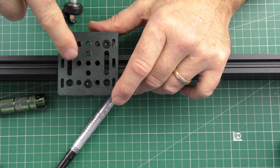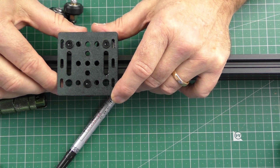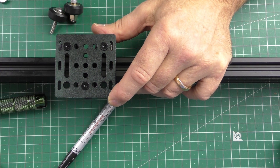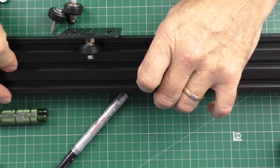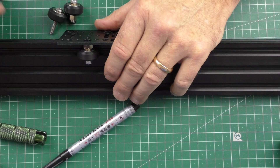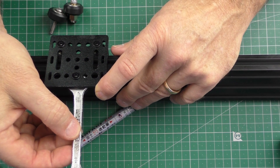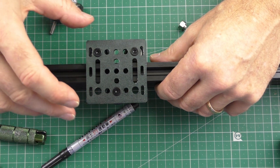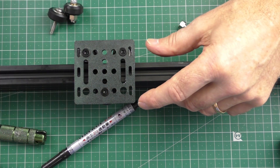This is a video for newer people, so it's very important to adjust this nut in very small increments — when you're moving your spanner it's like one degree at a time, if that. Then check that you can move the carriage. It'll have more resistance on your carriages because you would have the drive belt going back to the stepper motor — on this demo I've got no drive belt. Let me know in the comments below if this has helped you — no one likes tight nuts!